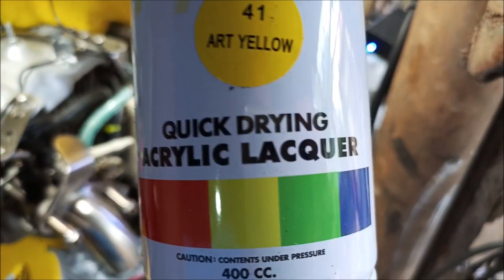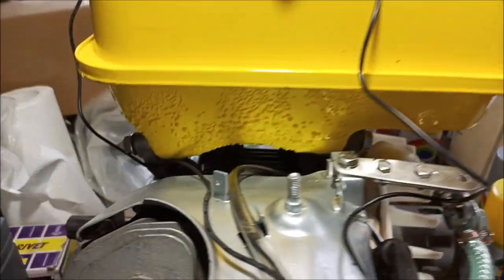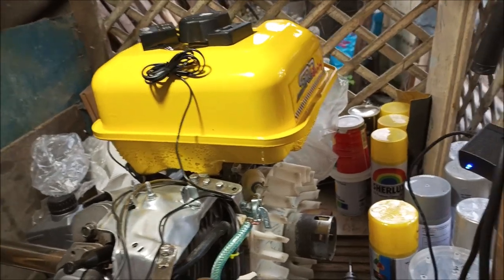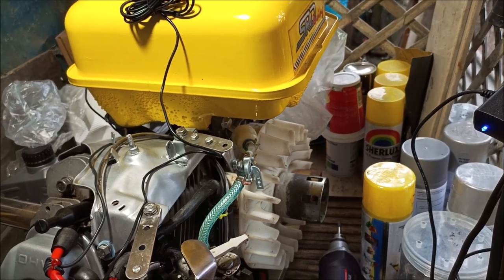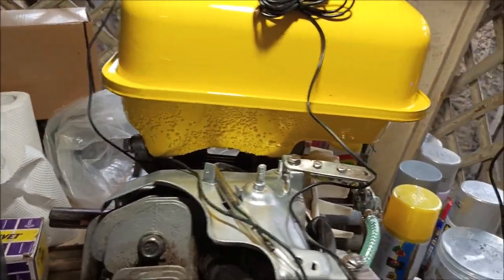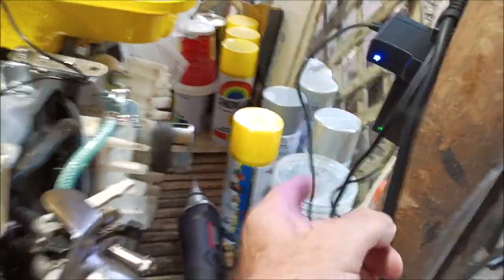The other weird thing — look at this gas tank, do you see that blistering? I painted it with acrylic lacquer and after it dries that's supposed to be gasoline resistant, but for some reason it isn't. Look at the bubbles. I've got gasoline up to about here in this plastic tank — only the bottom is blistering, only where the gasoline could permeate and soak through and blister up the paint. Gasoline shouldn't be soaking through a plastic gas tank.